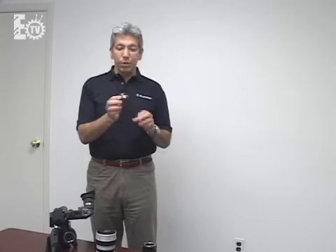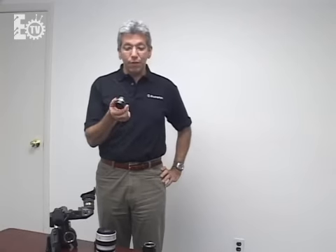That's really what you have to do at night to get the best performance. The resolution of these systems is described in line pairs per millimeter. This one is 64 or 72 line pairs per millimeter, which is a very fine resolution. In terms of pixel pitch or number of pixels, you'd expect a camera with about 2,000 pixels on a side to be approximately equivalent. If a camera sensor exceeds that, it would be exceeding the performance of the image intensifier tube.